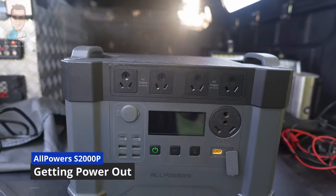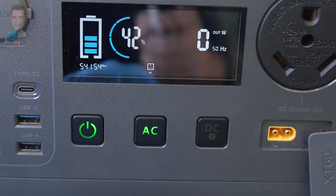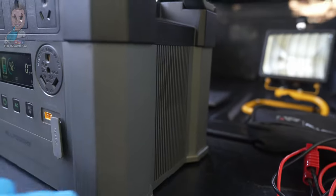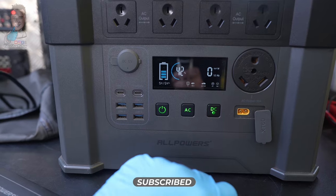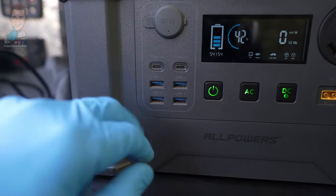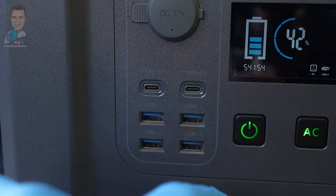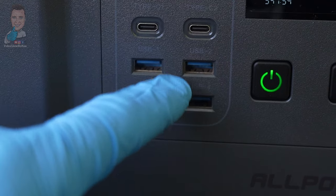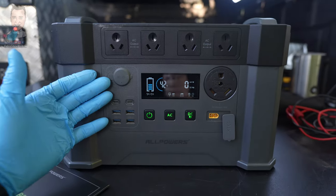From an output perspective we've got a bunch of options. We have our AC — this is the pure sine wave inverter — just hold that down to turn it on. You can see that flicks on in the controls. The fan automatically switches on as well, with one fan sucking in on one side and blowing out the other. On the left side we have all our DC — just flip the little switch to activate the car port and USB ports. There are two USB-C ports, both 100 watts each, perfect for charging your laptop or phone on fast charge. We also have four USB-A fast chargers and a standard cigarette lighter plug on top — perfect for plugging in your fridge.